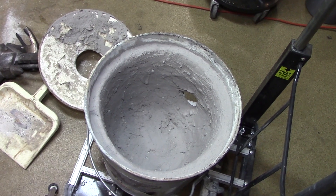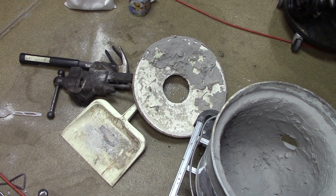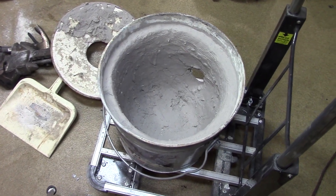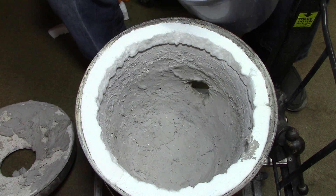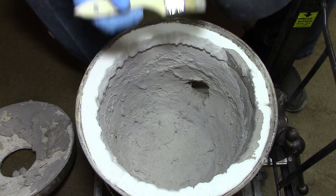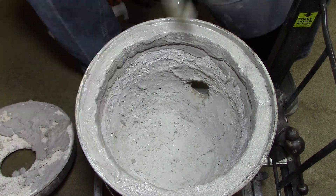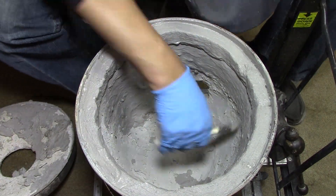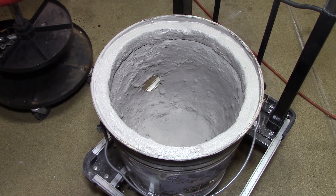That's what that one looks like, but the lid is so crumbly the stuff is crumbling, so I have to crumble a lot of that out of there and then try to redo the lid. I have enough kaowool to do the entire furnace, but since the sand and plaster of Paris below is sticking so well, I decided just to use a little ring of kaowool and put satanite on that to hold it. Here she is with two coats of satanite on there — and I did the lid as well.